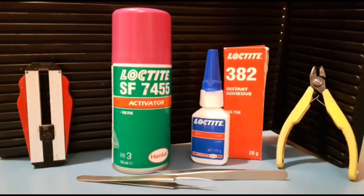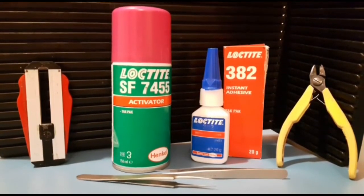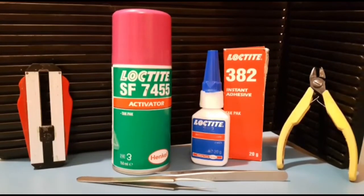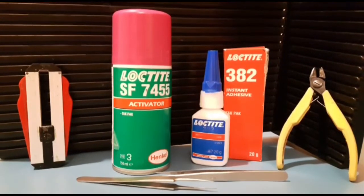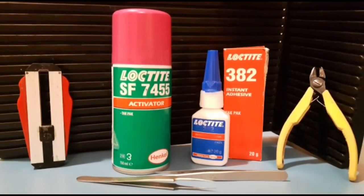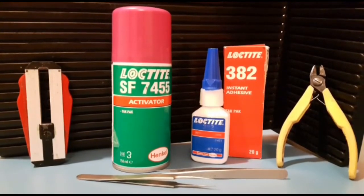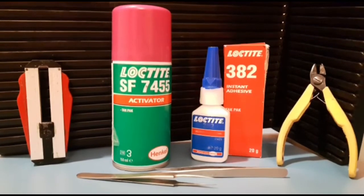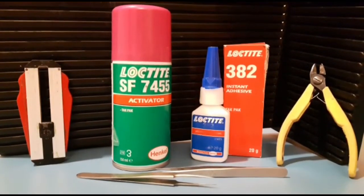Don't try and do too short of bends before your solder — the solder has to sleeve and go through the inner. Short wires should be pre-cut to length before you start, and long wires you do as you go. Those are the main tips. Kynar comes in a few different colors. I hope you find a few tips and hints along the way — please subscribe at the end.